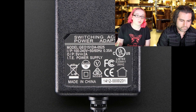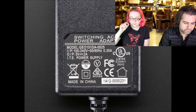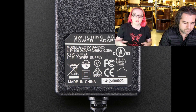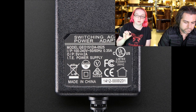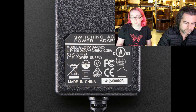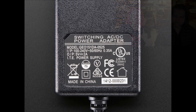If you want to run a single board computer, you definitely want a very good quality power supply. This one has extra thick wires and is slightly higher than 5 volt output, so when you draw two amps you still have about 4.95 volts at the end of the cable. You'll definitely be able to run your Raspberry Pi or whatever single board computer without worrying about brownouts. Most people think the power supply is the one part they can cheap out on — it's not.